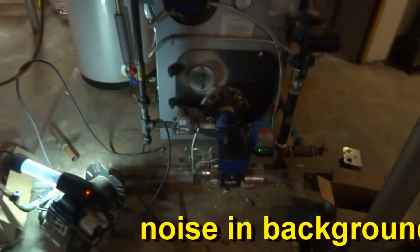And screw this on here, and run the TT to here over to the TT. So if this thing rolls out and heats up, it shuts the burner off. But I gotta get another one. I don't have that with me. But it's working. So what I could do is